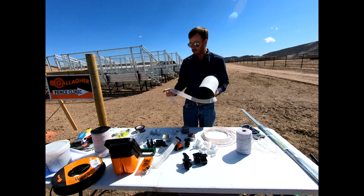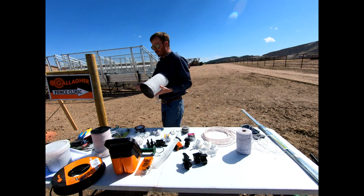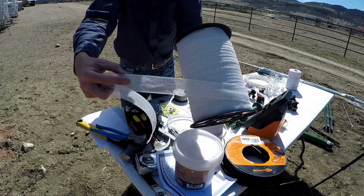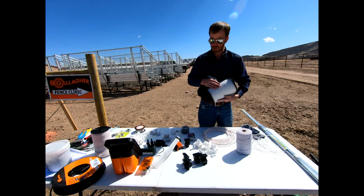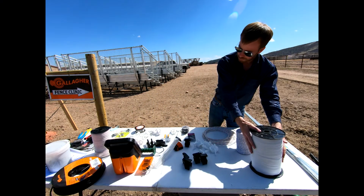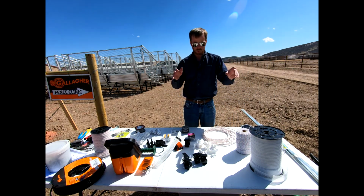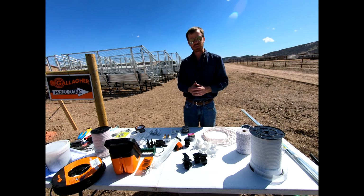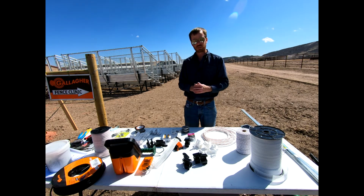And so whether you choose an aluminum wire or various ropes or various tapes, make sure that you do have something that is visible, that works well with your horses. And then from there you can hook it up to your energizer just the same, okay? So we've talked about those different products, from the wire to the ropes to the tapes. Let's talk about those insulators that you might see associated with them. Granted, you'll see them when we build our section of electric fence here shortly.